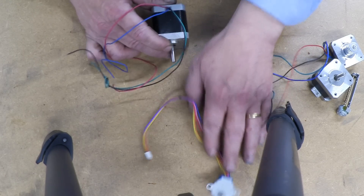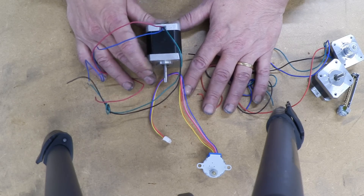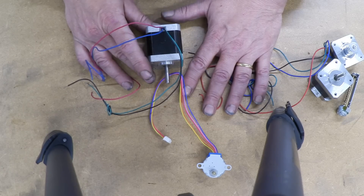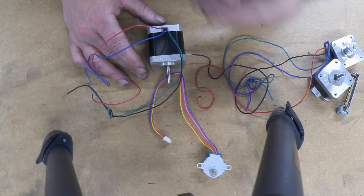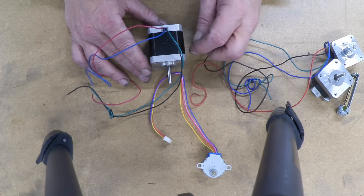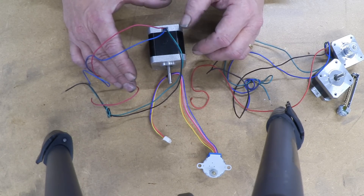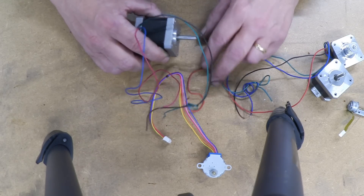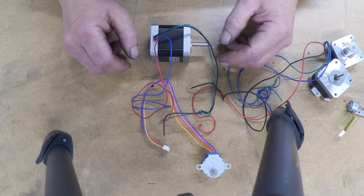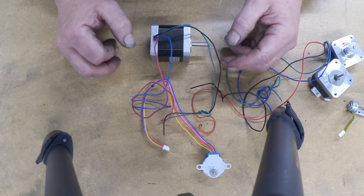Spinning the motor gives an AC output, but more often than not you want DC output. To get DC, we need a bridge rectifier. You can make one yourself — it's basically just four diodes in a ring. A very popular choice is the 1N4007 diode, which handles it just fine. You can also use a 1N34 with a very low voltage drop for tiny applications. Alternatively, you can buy a rectifier as a single piece. There's also a MOSFET bridge diode option worth looking into.